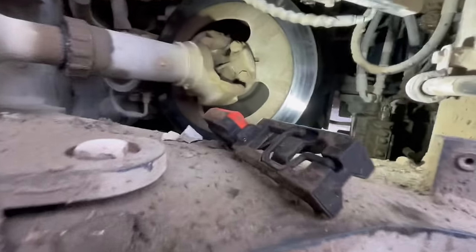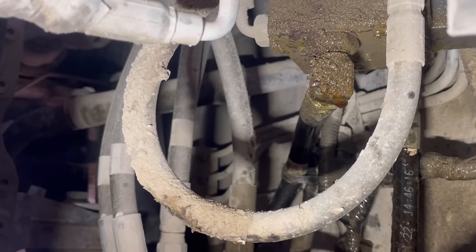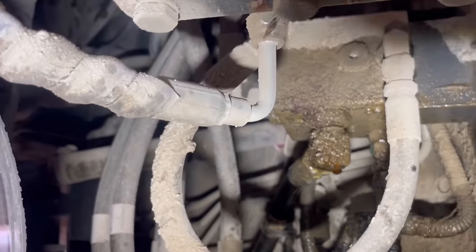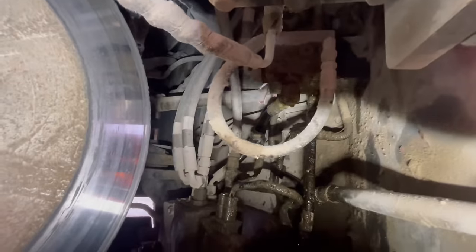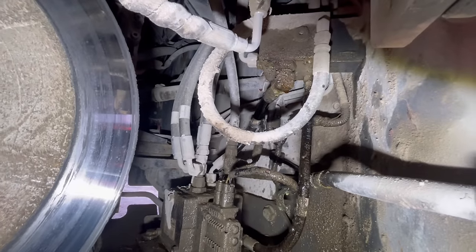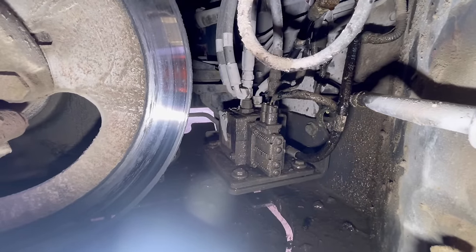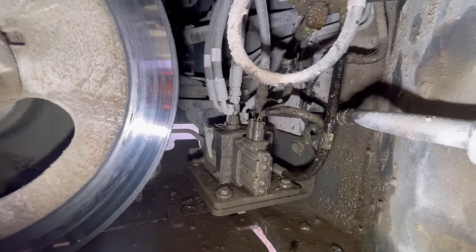Okay, so the hydraulic oil leak is either that pipe there or the fitting, or the one just at the back there, because it's drier further up, as you can see, and it's dry on that pipe there. I would imagine if we put a spanner on one of them pipes, we should be able to feel which one's come loose. It might even be that 90 degree elbow there, that directional 90 might be loose, but that is feeding the electric steering valve, that down there. So it'll be leaking when he's steering, is my best guess.